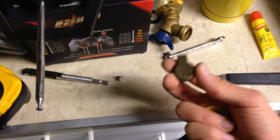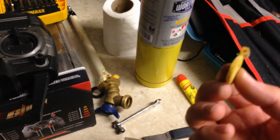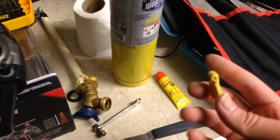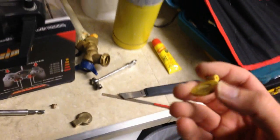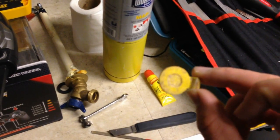All I did was chop the cap into little pieces, then made them even smaller with a knife. I took a plaster cast of the original valve, set it in there, let it cure. Then I put those tiny little pieces of plastic into the mold and put it in the oven for about 20 minutes at about 500 degrees. I let it sit until the bubbles stopped. It doesn't look pretty, obviously, but it will do the trick because it's an exact replica of that valve.